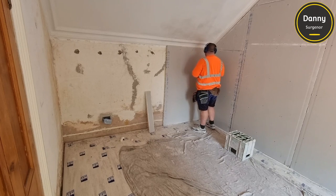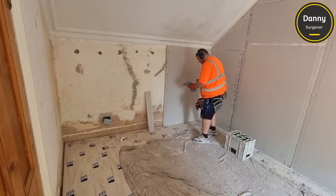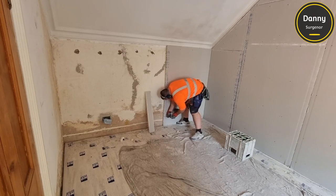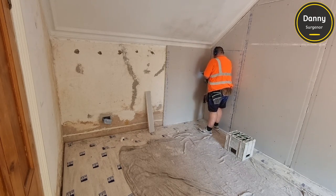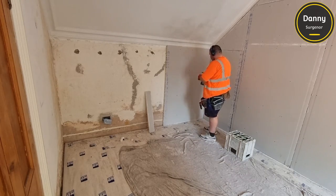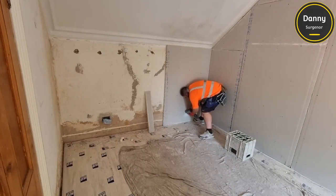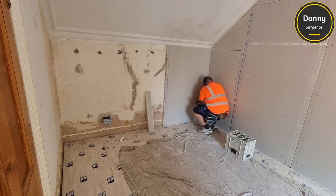You can see where I've marked the holes, and above those marks on the cornicing, I've marked where the joists are behind this wall. It's a good idea when pricing the job to measure the space you have behind. I bought four-inch screws, wanting to be sure they would go all the way through, but they were just slightly too long. So a lot of the screws are put in at an angle - just to stop the screw going out the back of the wood and pushing the wood away from the wall.